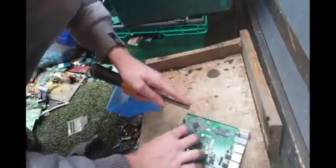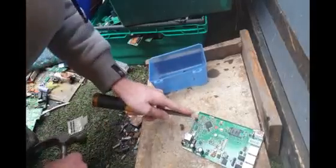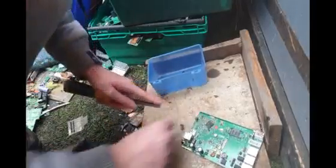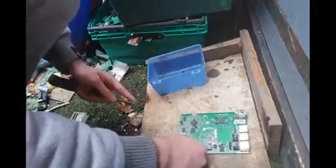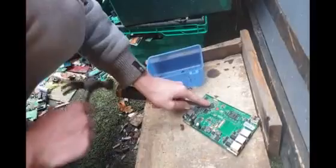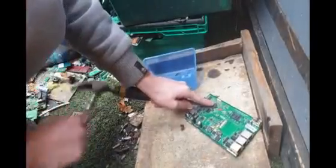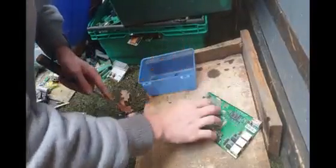You can save solder. I personally aren't going to do that, just because this type of BGA don't really want to release much solder. As you can see, you couldn't even see any solder come off that time. Whereas flip chips and gold corner BGA, they're much larger, and because they're harder to come off, you scratch a lot more solder off the board. So then it's worth saving.